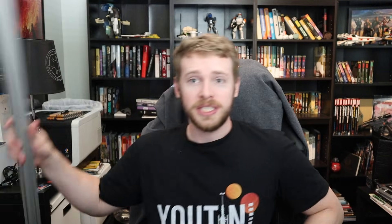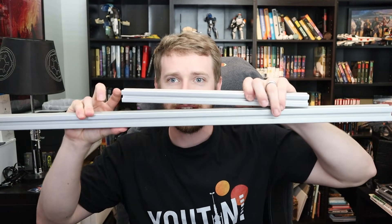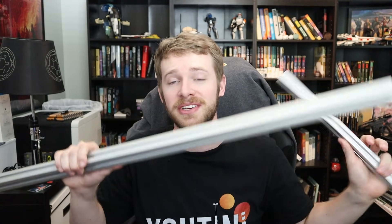I don't really think there's much reason to go much bigger than the 10 series or the 15 series. This stuff is incredibly strong - this is about a 14 inch piece and there's no way I can bend it at all. It is incredibly, incredibly strong. I've even tried to bend the longer pieces and I can't. I can kind of make it bow just a little bit with all my strength, but this stuff is so strong. The shape of it is what makes it so strong. So you really don't need as much as you think. I was originally gonna go with the 30 series, which is quite a bit bigger than the 10 series, and I'm kind of glad I didn't. It's definitely heavier and bigger, and yes it's stronger, but it's probably unnecessary to have gone that big just for cabinetry.